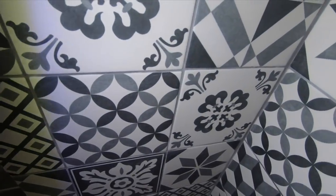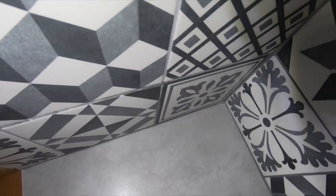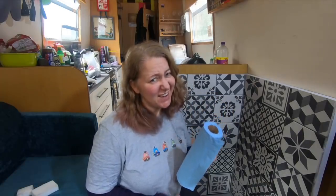Finished! It is all finished — all the grout in the tiles and the bottom. All we have left to do is the trim but I'm really happy with it. My third tip is try to use some paper towel or a bit of cardboard at the bottom of your tiles especially when you're doing wall tiles, because I did have a lot of grout fall down on my main tile and that just involved a lot more washing up.